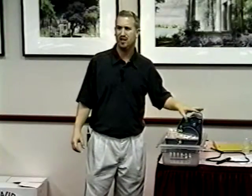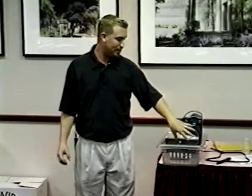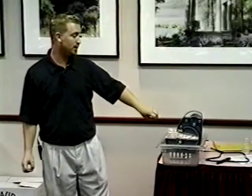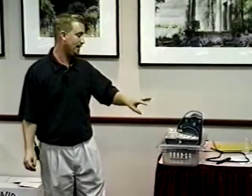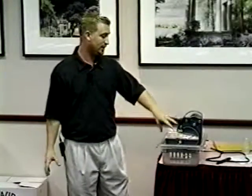You're not going to really have loose tension with these newer saws, because we learned a lot more and we make the saws better. When we build these saws, the variance in this diameter is only a couple thousandths on every saw — and I'm proud of that because this is all done by hand with our own fixtures. It's only a few thousandths or a couple millimeters that make a difference when everything is a circle on top of a circle on top of a circle.